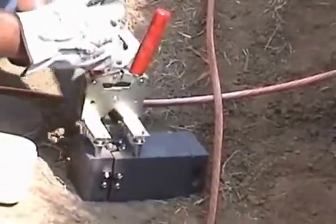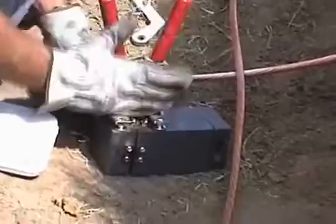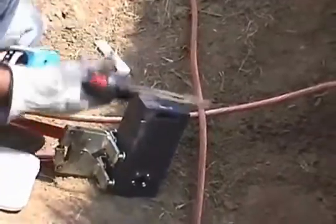Now that the cables are ready for the mold, make the mold ready for the cables. Insert the offset handles into the mold. Thermoweld offset handles for the two-piece CC11X mold with wear plates provide a more convenient side mount position. Other brands require a more expensive three-piece mold design.